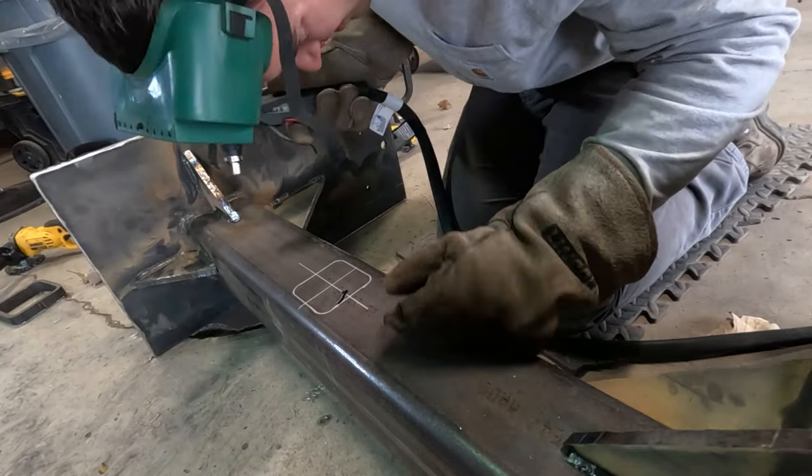Got the safety chains hooked up to the binder. I ended up taking out the hitch pin, and I read a few things online that a grade 8 bolt is actually stronger than the hitch pin, because there's no slop in it, because it's sucked down, where the hitch pin had some play in it. So hopefully we're safe there. First day of trying that out. And this is kind of how it ended up.